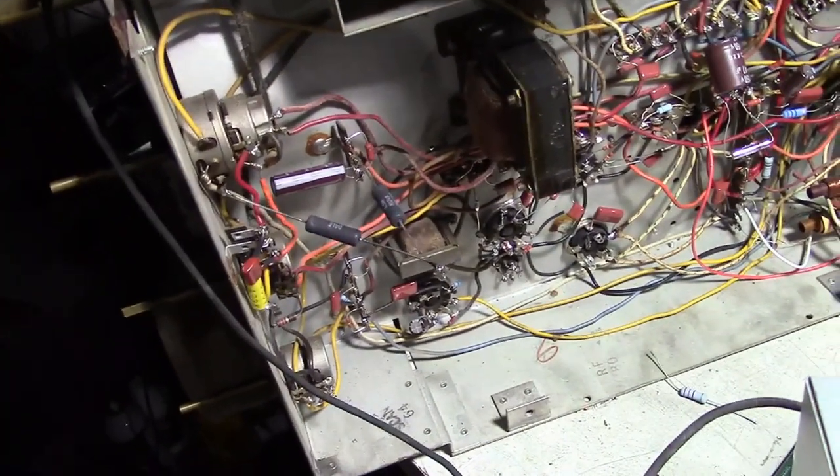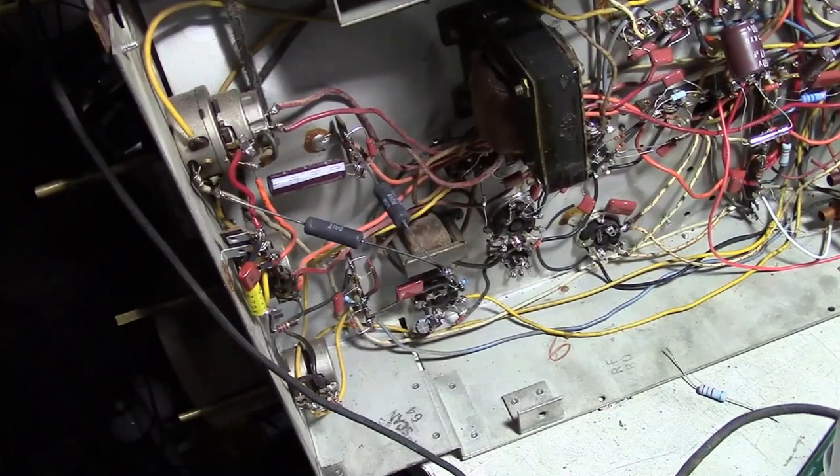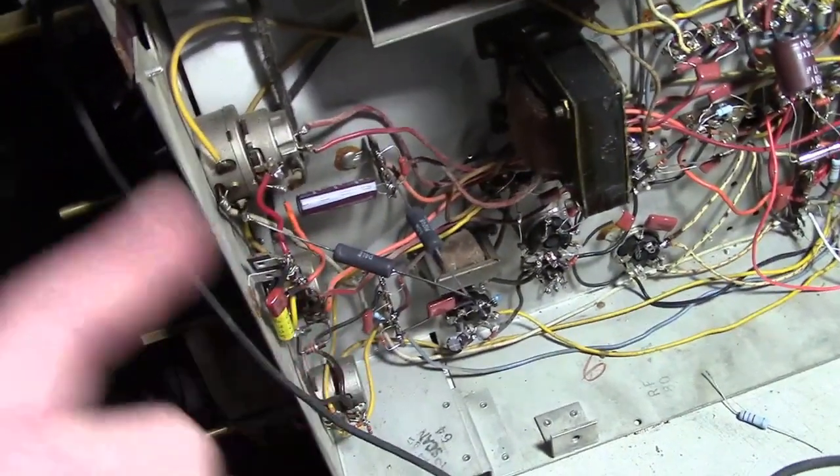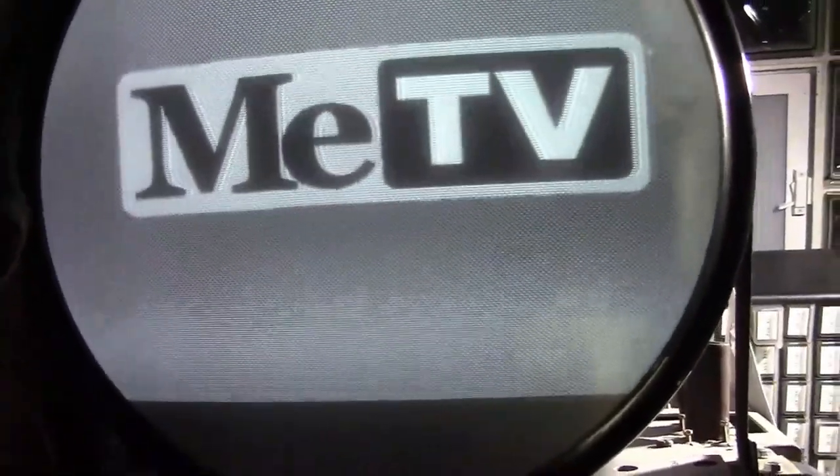I'm not sure if I have any more 3k power resistors on hand, but I've got some 1.5k big beefy ones — I put two of those in series, that gives us 3k with plenty of wattage so they won't be burning out any time soon. And did this take care of all of our troubles? It sure looks like it did. We've got good focus right about in the middle of the control. Let that be a lesson: don't overlook the obvious. Maybe the new part you just put in is at fault, or maybe it was good but burned out while you were working on the set.